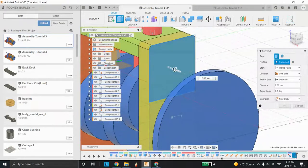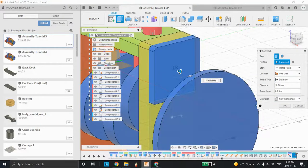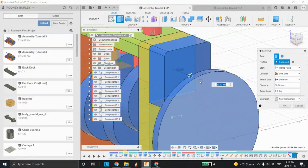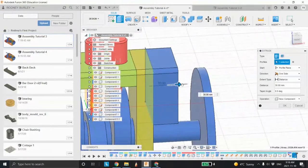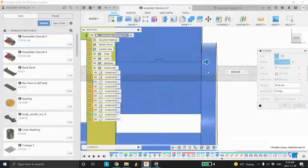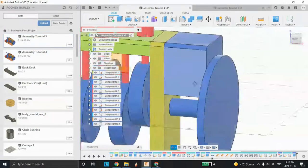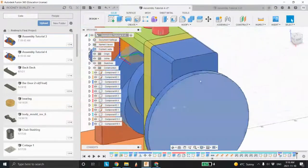Right-click and press pull this. As I pull it out, you can see it's taking on that previous radius, which is nice, but I want to have a new component so I don't have to continue putting a radius. It was going to be blue, so I'm going to come up against that face there. In front view, it's sitting nice and tight against that front face as a new component — that's perfect. That's my braking block.